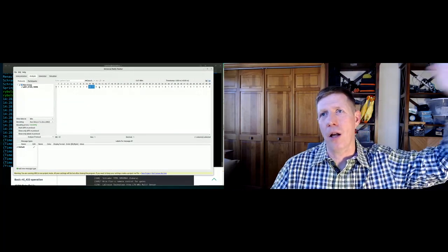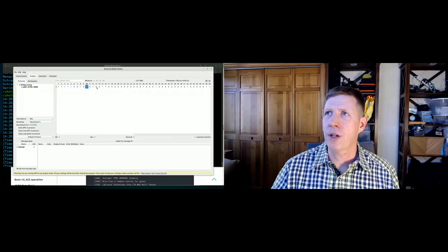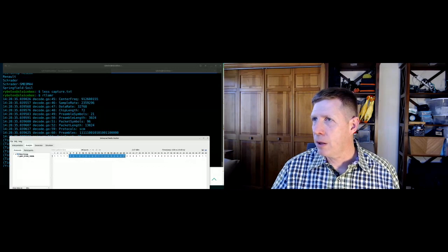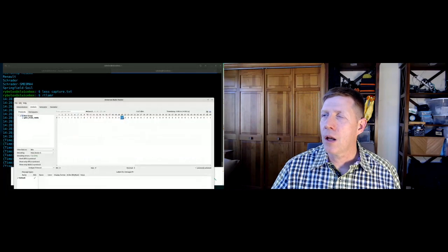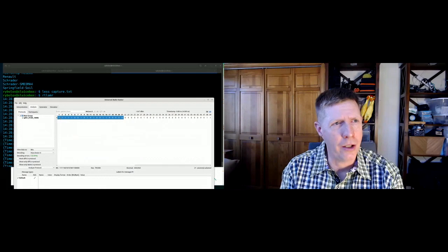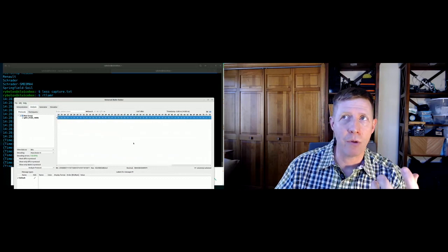The short answer here is for our protocol, we can go to Manchester 2 and I get this nice, awesome, schnazzy 11111001010100. And if we go look here, I've got 11111. There's my clock, and then I have 001010 and so on, and then a bunch of zeros. I don't know how many: 1, 2, 3, 4, 5. Something like that. Don't quote me on this, but that's my preamble. Here's my clock, and then standard consumption message to follow. So anything from here on out is going to be the data that was in that signal.